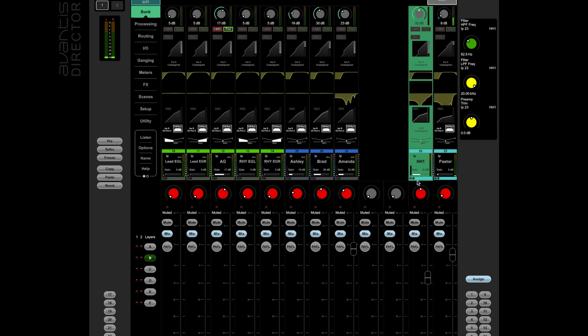So the question is, if I can't hear it, how does it affect how I sound? Basically, what we're trying to avoid as tech people is overcompressing. We don't want to take this and make it this, because when that happens, it sounds really thin, really boxy, and it's not pleasing. If I overcompress Logan's guitar tonight, he's going to be really thin, and quite frankly, it's not going to sound very good, which would be a big bummer, because you have good tone. Yeah, I'd appreciate that not happening.